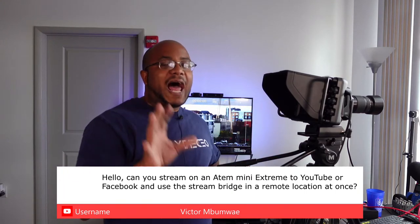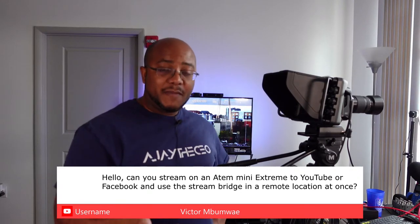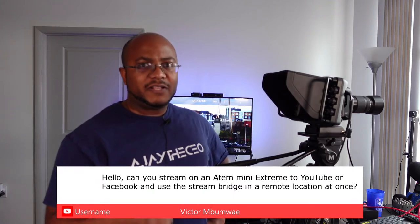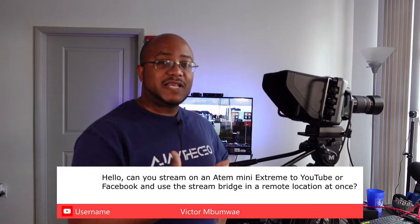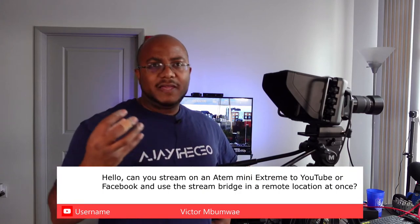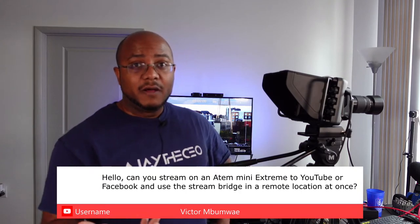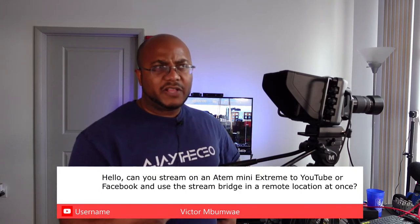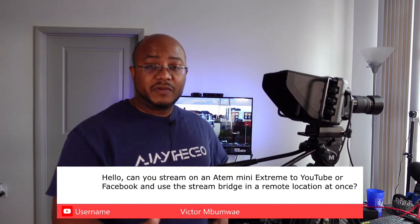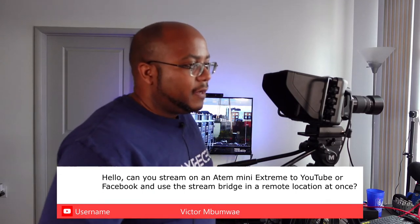I would honestly say I like the streaming bridges, but I think there's some type of proprietary stuff that's only letting Blackmagic stuff stream to it, because I've tried with Vimeo and OBS, streaming directly to it, and it just spins. I think it's looking for some type of handshake. But Aaron, I tagged him in the video, actually showed a tutorial on how to use the Raspberry Pi 4 and higher, to make a DIY version. Actually, I think I'm using a 3 and it works fine for me. I'm able to stream to that with the ATEM or with anything else. That's what I'm using.